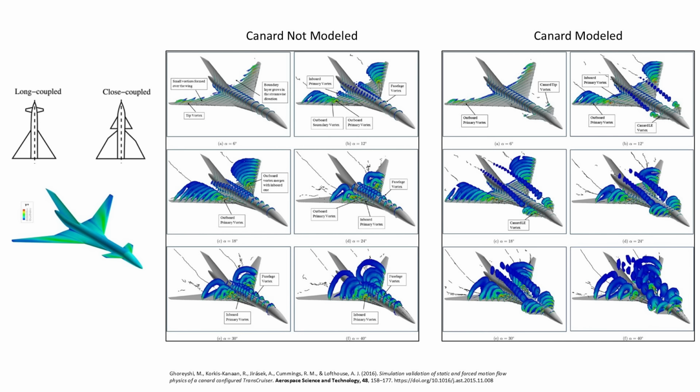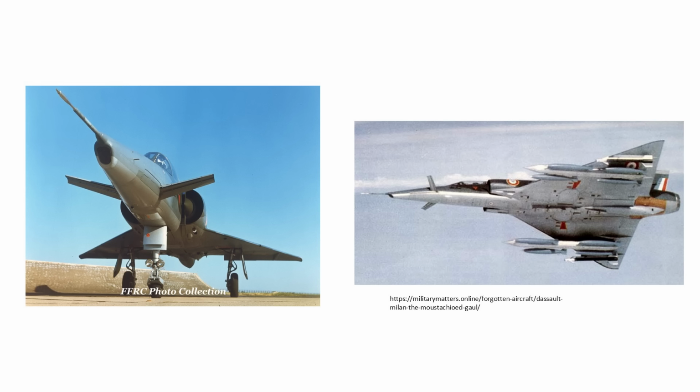So because the total instability of the aircraft using the long arm canard has to be greater than that of one using the close coupled canard for the maneuverability benefits we just mentioned to be realized, the long arm canards are inferior for maneuvering combat regardless of instability levels, and they're generally a better choice for bomber interceptors, supersonic bombers, and civilian aircraft than for air superiority. But even then, there's always an oddball exception like the Mirage Milan with its long arm canard with an insane amount of dihedral for some reason.